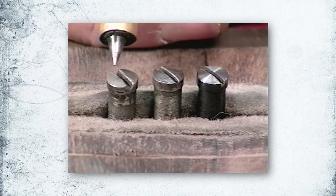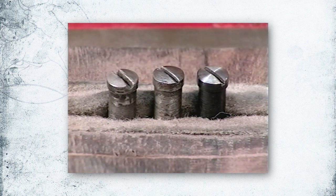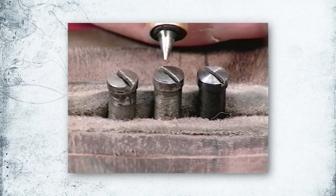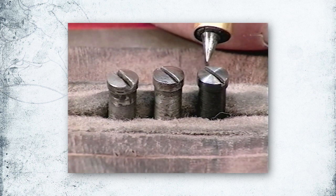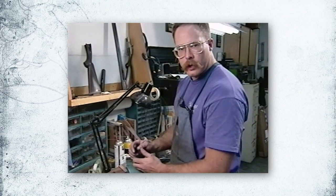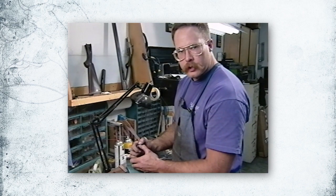These are three different examples of the screw. Here you can see the screw that's been damaged by the screwdriver — the head is kind of wallowed out where the screwdriver's been twisted. Here you can see an intermediate process where it's been tapped back down and the finishing process started. And here you can see the finish with concentric circles after polishing. If the screws aren't quite bad enough to need welding, you can tap them back down with a smooth hammer.